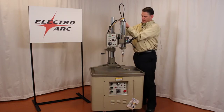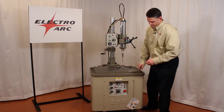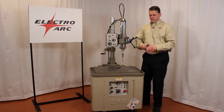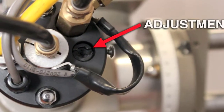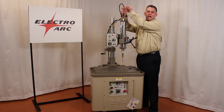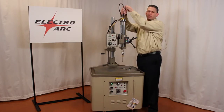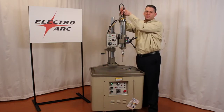So we get the set screw out of the way, and then we want to turn on our head vibration. We take our Allen wrench and come up top here. By turning clockwise, we increase tension of the spring adjustment. By going counter-clockwise, we decrease spring tension. And while we are rotating, we are paying close attention to how the sound is resonating.